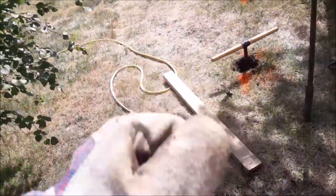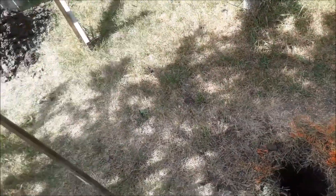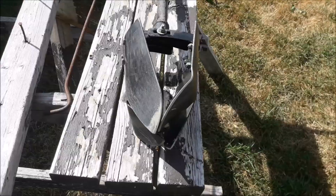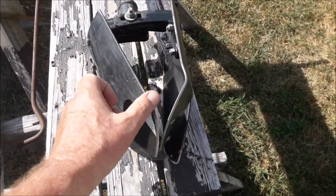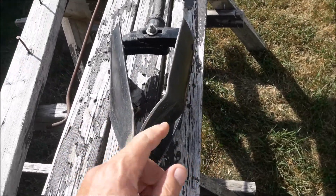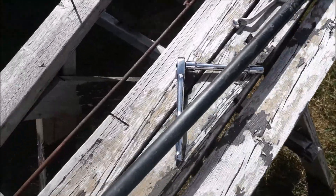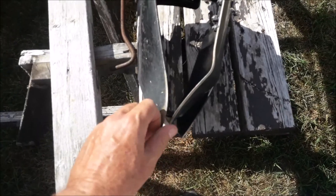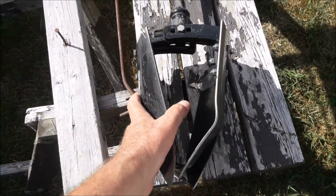If you've got a bench grinder, seriously it only took me about 15 minutes to sharpen, and that just saved me another two hours of work, minimum. I just finished the last section — you can see it's already dulled but it was still cutting nice. That was roughly 5 feet of drilling, and when I was tripping out I was pulling full, overflowing augers.